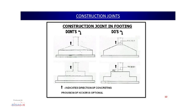We have to understand the basic theory behind the design of the slope footing, and we have to ensure this portion as well as this sloping portion is cast monolithically, so that they behave as a single unit. One kicker or starter also we can give, but this is optional. We can very well put the starter the very next day.